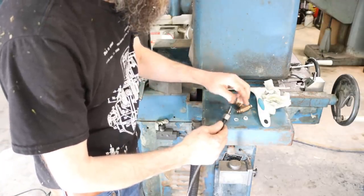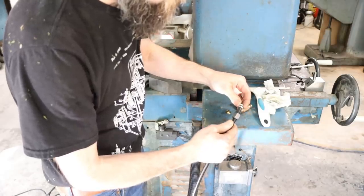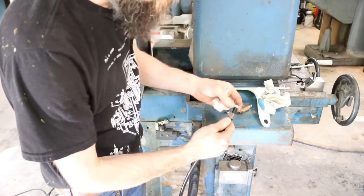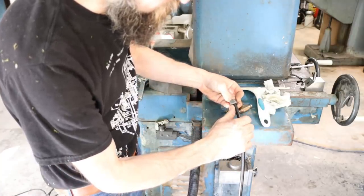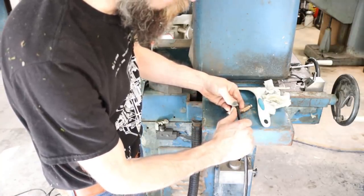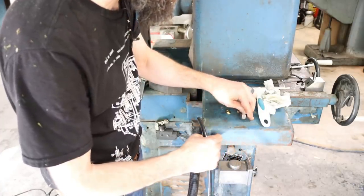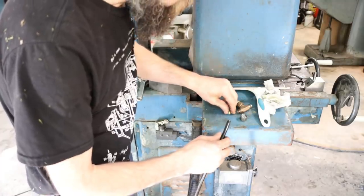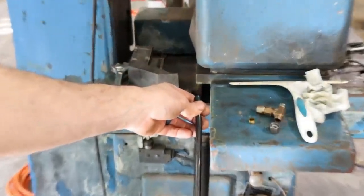And plus, what I was using was a compression fitting, a Teflon ferrule, which is pretty slippery in itself, on plastic tubing. So once that pressure built in the line, when I shut off that valve, it just pushed this tubing right out of the fitting, and then we had a fountain of coolant. Let me get you a little closer and show you these ferrules.